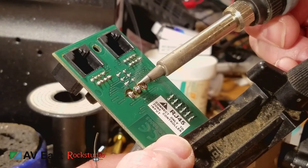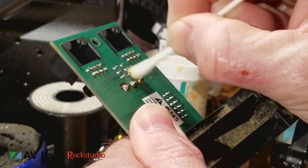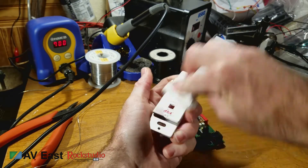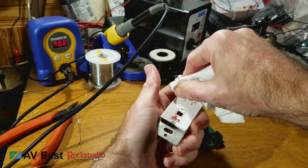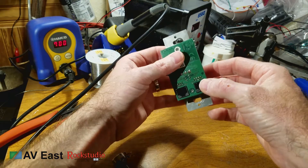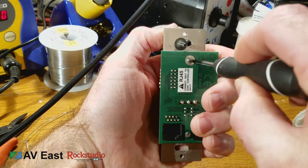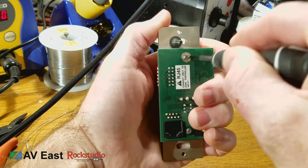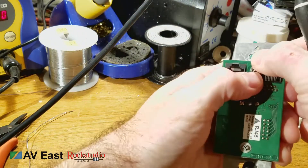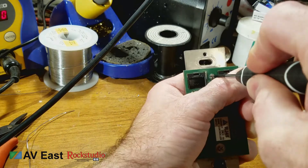When you're done soldering, use a little alcohol on a cotton swab to clean any remaining flux off the circuit board — it's just a way to keep things neat and tidy. Use a little bit of that alcohol on a paper towel to clean the faceplate off as well. My main market is audio systems for restaurants, so the volume knobs and source selectors get pretty grimy and greasy over time, so I typically clean these pretty frequently. Now stick the stem of the pot through the hole, then line up those posts on the back of the circuit board and use a small screwdriver to gently spread it out. Keep in mind you can break those little ends off the post pretty easily. Now that you've got that new potentiometer installed, hook it up to your zone control bus and see if it did the trick.